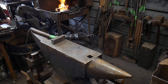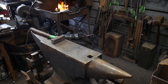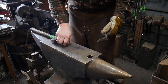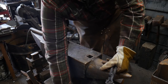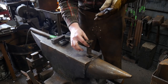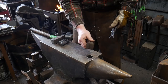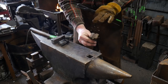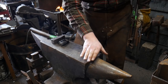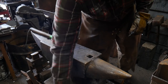Now this is very much different. You guys have seen this tooling before. This is different than a top swedge or a bottom swedge in the anvil. Although you could use this tool for that, this tool is actually meant to dig into flat metal and push things aside — so it's kind of a bit of a butcher tool. It's not meant to complement a bottom swedge tool like this; it's actually meant to dig into metal and leave a raised hump in the middle. So that's what we're working on today.